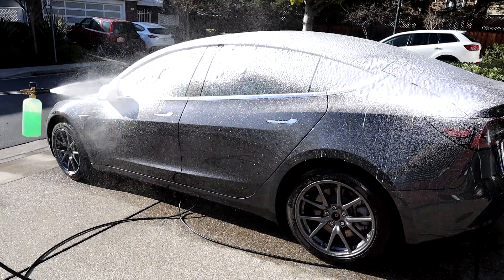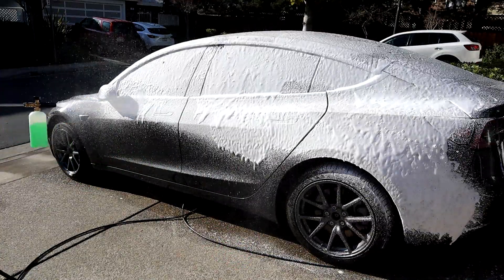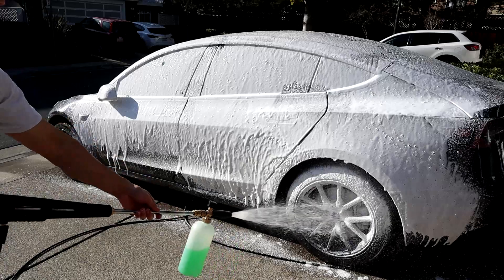Don't use a pressure washer when you're cleaning the panels. You don't want to use pressurized water because pressurized water and glass is not a good mix. Basically the pressure can actually crack the glass, especially if the panels are in the sun — that expansion and contraction can cause the panels to crack. So you just want to use regular hose water to wash the panels off.